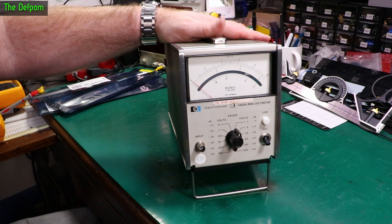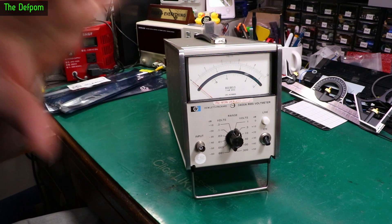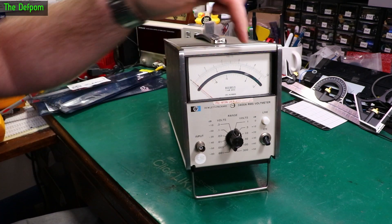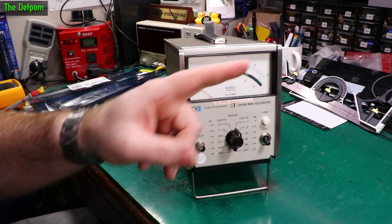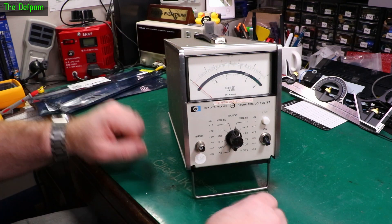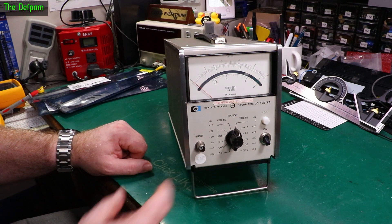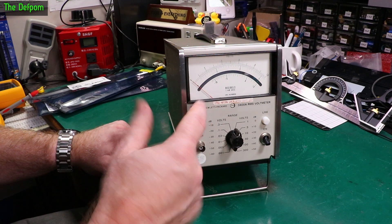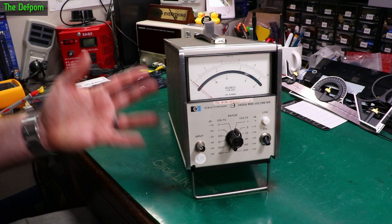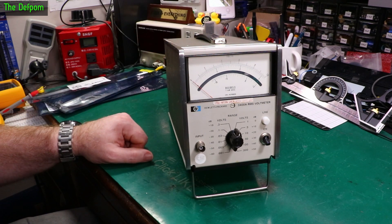Well there you go - it's back together again. I've gone through the calibration process and checked it out. It's got a bit of a linearity issue between about 1.5 kHz and about 100 kHz - in that range it ends up reading a bit higher, probably about 5% to 10% higher. But the rest of it's actually looking pretty good as far as responsiveness and linearity. So I'm going to put this in my other lab and put it to one side - I'm sure it will work fine next time I go to use it.